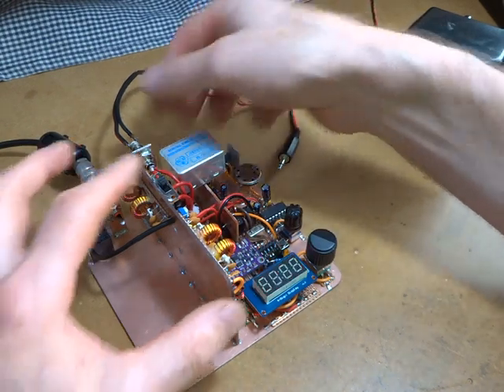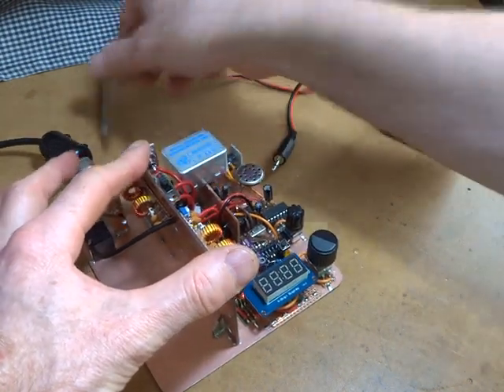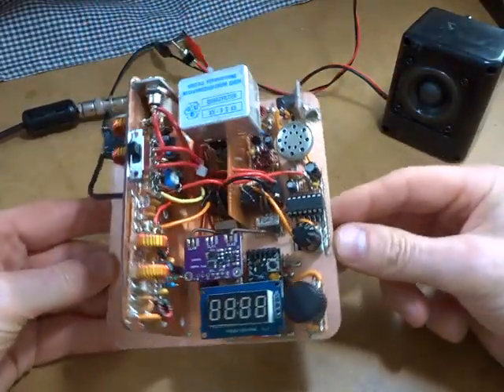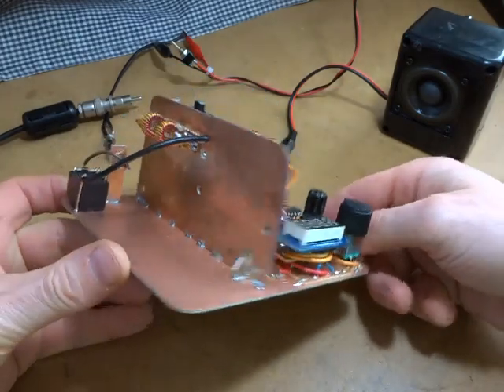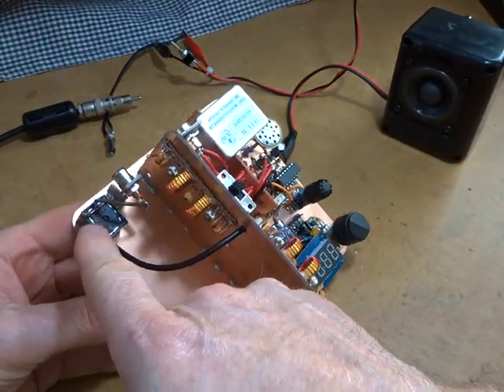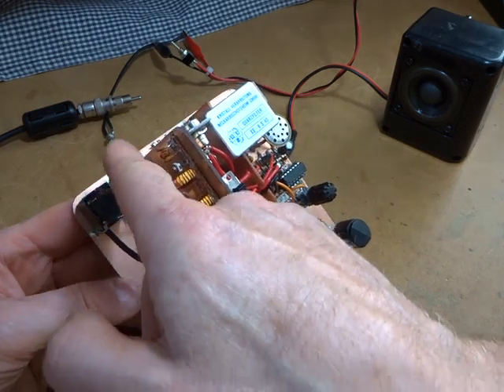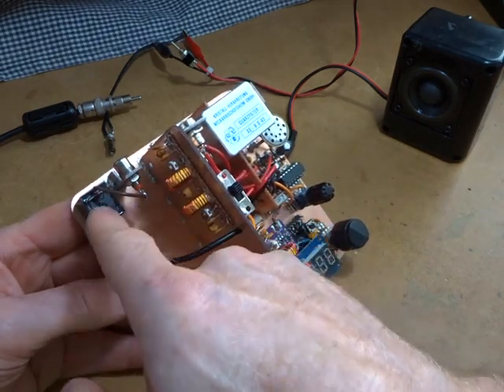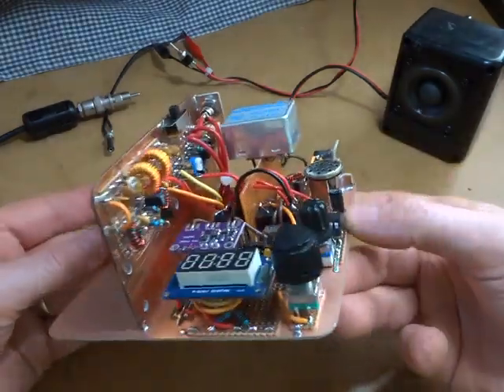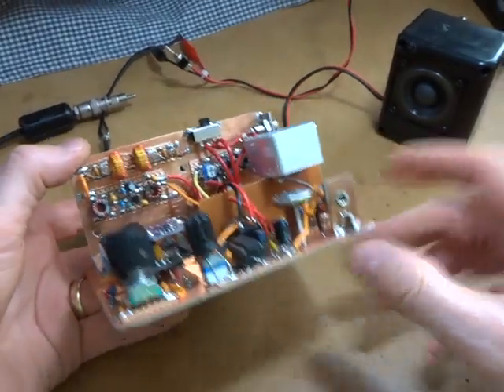Let's just have a quick look at the configuration and then I'll look to continue on with the transmitter. The dividing wall is now in, so we can see here the TR antenna relay is in place. I've got RF coming in from the antenna — the normally closed contacts takes the RF through to the bandpass filter on this side here.